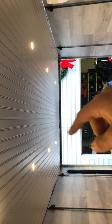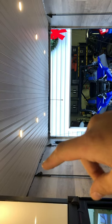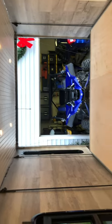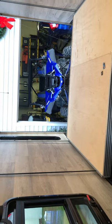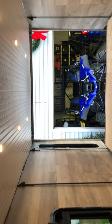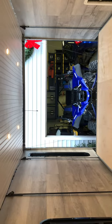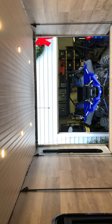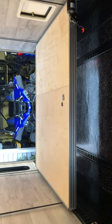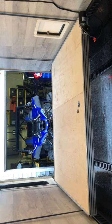With the garage lift modifications you're still going to have cables and pulleys exposed, and if you're in bed near those cables your hair is going to get grabbed — same problem as the winch method. Those garage lifts are also pretty cheap and flimsy — they'll flex once you get them bolted in. I was talking to another person who did that and he ended up scrapping the whole design. That covers most of the methods I can think of.